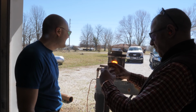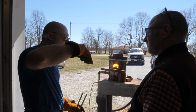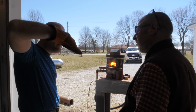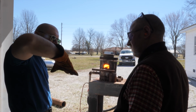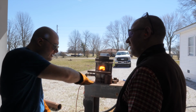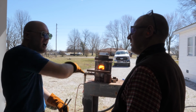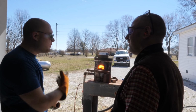Yeah, the pattern will get finer at the point because you're pressing. Also, the more you forge it out, the more the pattern, which is on a 45-degree angle right now, flattens out. Forge it out a bunch, and the pattern will just be going across on these real long, I think they call it a waterfall pattern or something. Yeah, that's kind of what we're doing, not really.